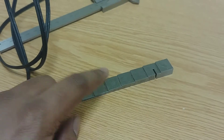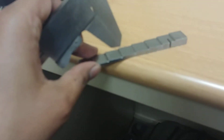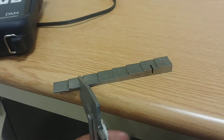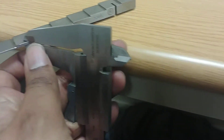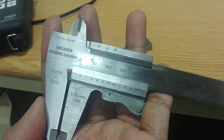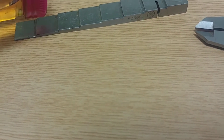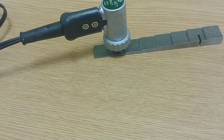Let's take the second step of the block as our low reference. First, measure its thickness using a vernier caliper. The thickness comes to around 2 mm, so we'll take this block as our minimum reference. Now, put some oil on the surface — you need couplant; without couplant you'll get a wrong reading. Apply the couplant here.